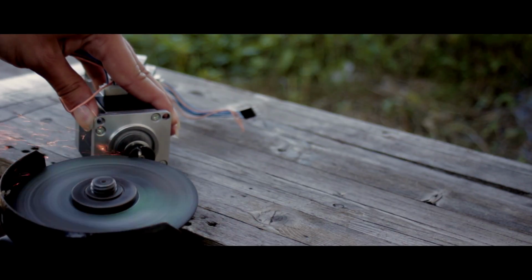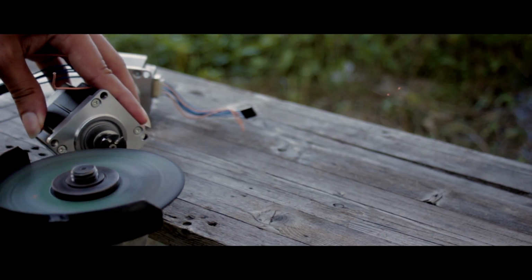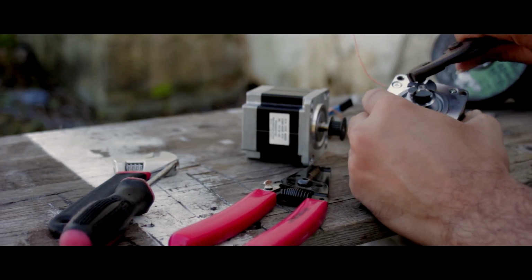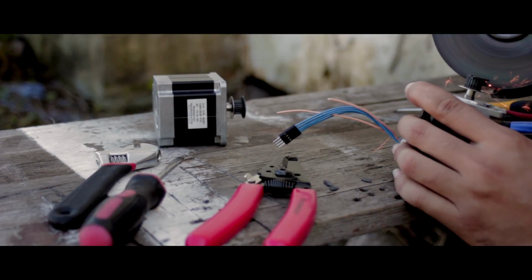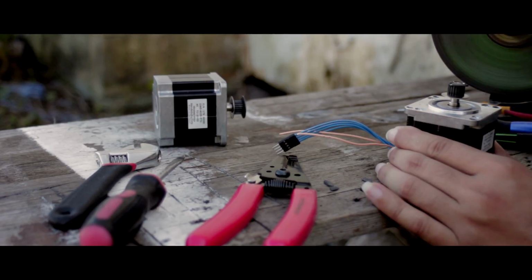As you can see, I'm cutting in 4 different angles. I start off with one cut, then I go to the other 3 on 4 different sides so I can get a pair of pliers to kind of pull the pulley off of there. It just takes a little while because it's so hard to get through all the metal. And then on top of that, I have to shave it down off of the actual shaft because it's all welded on there, so the metal has to be shaved down as well once I start ripping the pulley off.